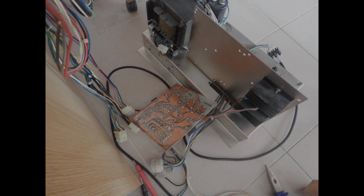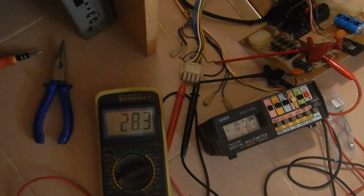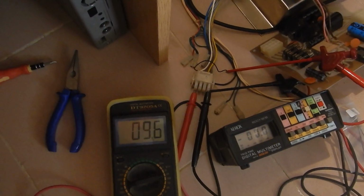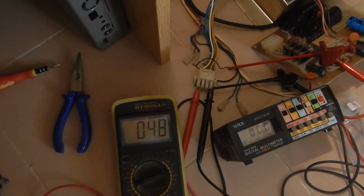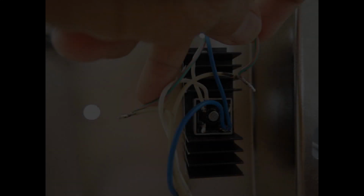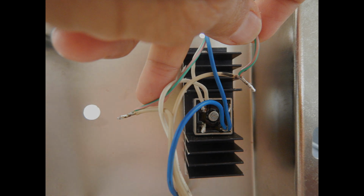At this point, it's evident that the fault is in the power supply itself, so I disconnected the regulator board and I'll measure the unregulated voltage first. Oh, another blown fuse. However, observe how only the positive rail voltage raised, and on the negative side it remained at 0 volts. So I disconnected the bridge rectifier, that it doesn't seem to be shorted anyway, and removed both filter capacitors.